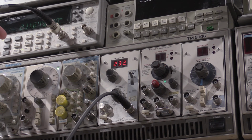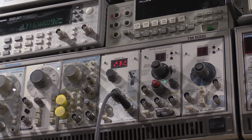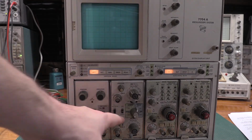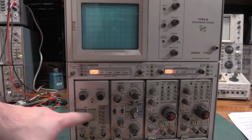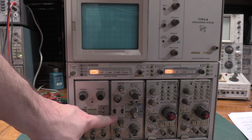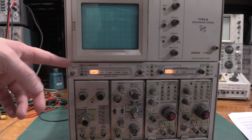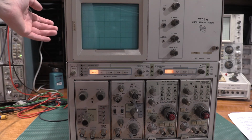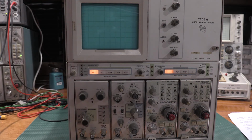And we're at 231 megahertz, so we are good to go there. Everything is working. So we make frequency spec barely, so I checked the other compartment as well. It's 230 megahertz on the left, 210 megahertz on the right, so these actually don't follow the same bandwidth spec. However, there's only one bandwidth adjustment on the board. So when you do it for the vertical amplifier, just make sure everything's in spec.